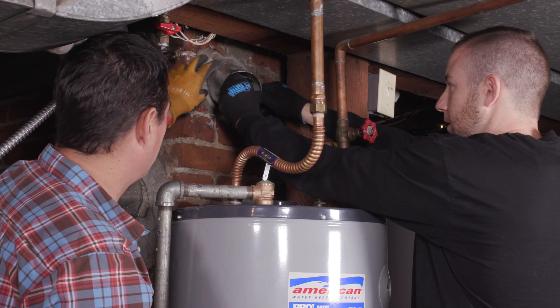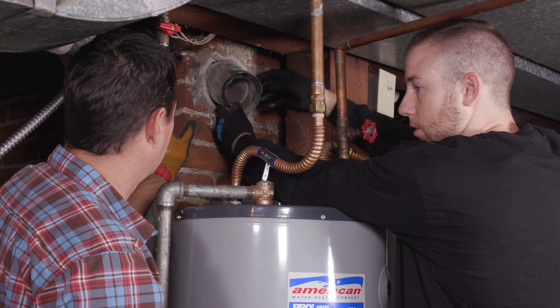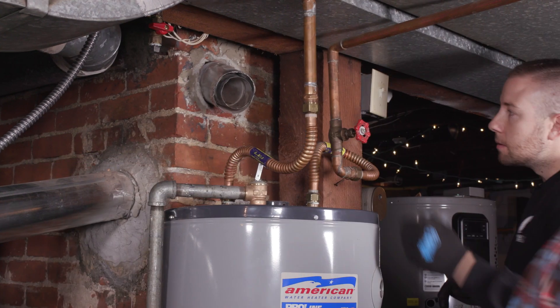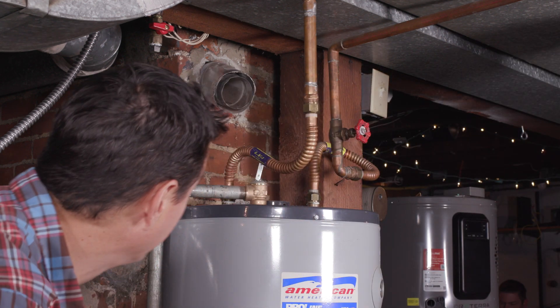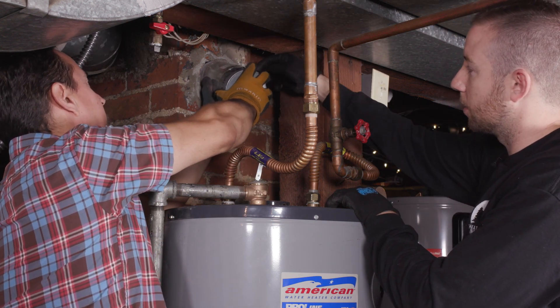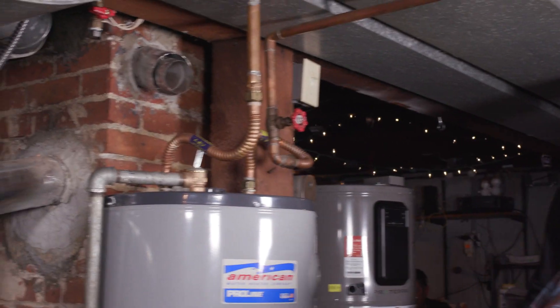When you get your cap on here it's going to hold this back because we're going to get screws in that cap. We can test fit the cap now — here's our four-inch cap. Test it before we crimp it because you never know how it's going to fit. You can see it's almost the same exact width as this pipe, so we're going to want to crimp the cap down. We've got our specialty crimping tool.